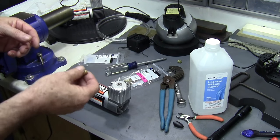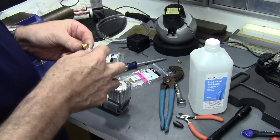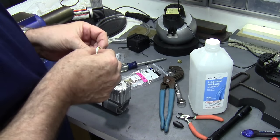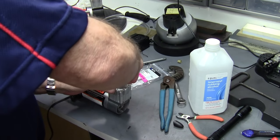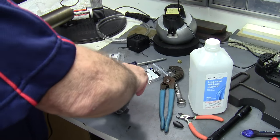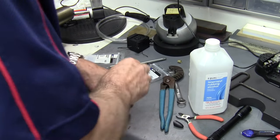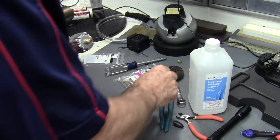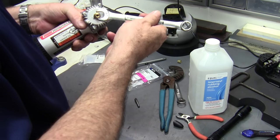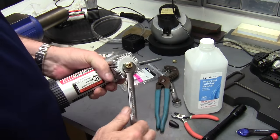And there you have it — I opened that hole up to the same inside diameter as the tubing. Now what I'm going to do is put a little ribbon dope on it to make sure I've got a good seal. This stuff definitely gives me a good seal. Alright, knock the burr off of it — not that it matters. Use a 7/16th wrench to tighten that on down.